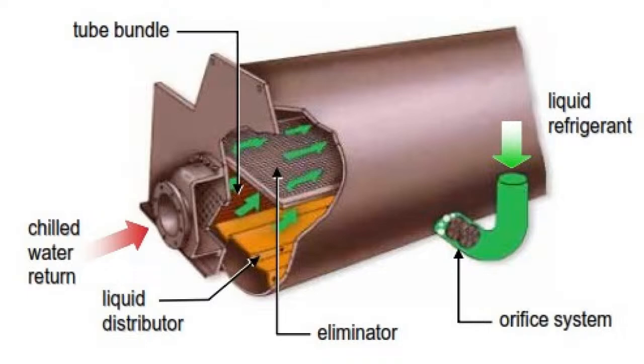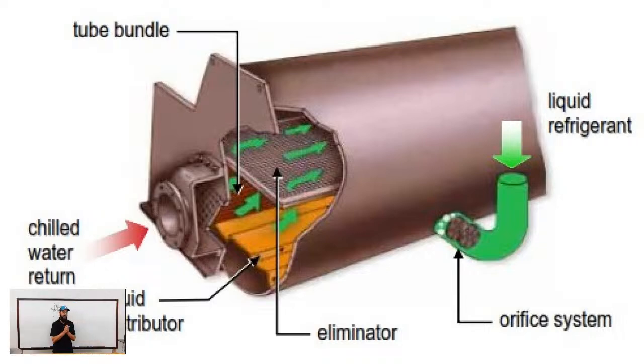It is forcing the refrigerant to pool more evenly, because what will happen is if the eliminator is not there, right where the suction elbow pulls from, the liquid refrigerant will build up and pull up into it, and you'll have this big hump right there underneath it. That's because there's so much velocity and force flowing from the compressor pulling the suction gas back. So by putting the eliminator in there, it reduces that effect and helps spread the liquid refrigerant pool across the entire evaporator, instead of it being allowed to pool in just one section. So those eliminators are very handy.